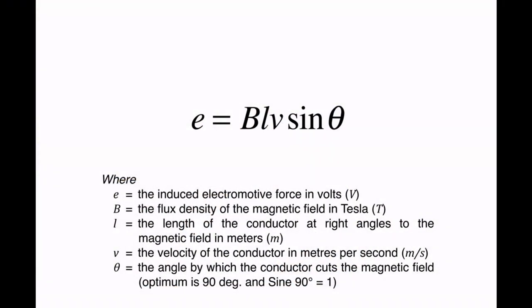So it's a much simpler system. But different things happen when you change some of those factors. What we're really interested in when it comes to generators is how much can we get out of it — we want to get as much as possible by playing with those factors. Changing the speed is pretty obvious, and we do that quite a lot. Changing the amount of wire that goes in there is pretty obvious as well, and you want to cram in as much as you can. Changing the strength of the magnetic field — use strong magnets. The problem with that is they tend to be a bit more expensive. One of the things that people get a little confused about and doesn't get much attention is that idea of the angle that you actually do these things at.